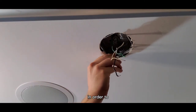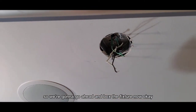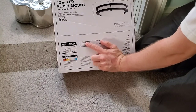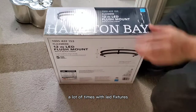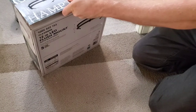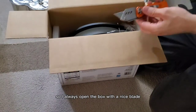Now we're going to put the screws back in — these screws also come with the new fixture, so in case yours are stripped or too short, you're covered. Basically there'll be holes that line up after you connect your wires, and the new fixture will slide over and then you'll tighten the screws. Some things to note: if you have a dimmer, you want to make sure your fixture is dimmer compatible. A lot of times with LED fixtures the main problem with why they may die early is because they were on a dimmable circuit and the fixture wasn't compatible.